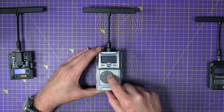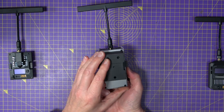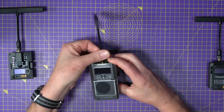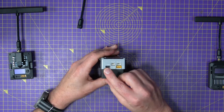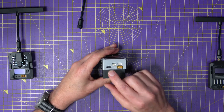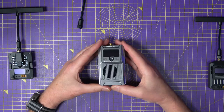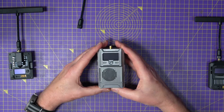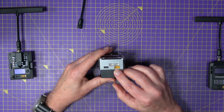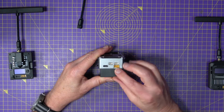There's a high-contrast OLED screen with a button joystick to navigate the menus, and a couple of programmable LED illuminated buttons. There's also an accelerometer built in, so the screen will automatically blank when the module goes upside down when you're not looking at it — a neat feature. On the bottom there's a USB-C connector for flashing firmware, and it means you can power this from an external USB power pack. It also supports Wi-Fi and Bluetooth, so you can flash it wirelessly. There's also an XT30 connector if you want to power it from an external LiPo, anything between 2S and 4S.